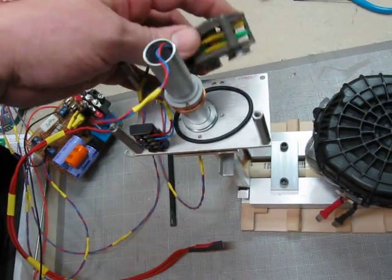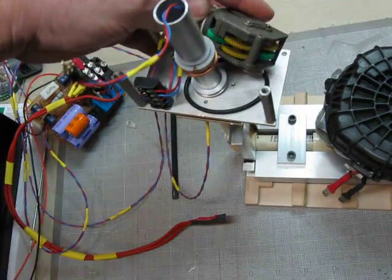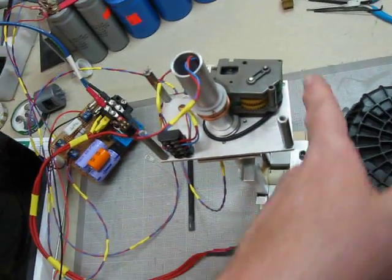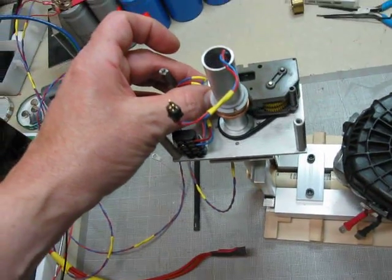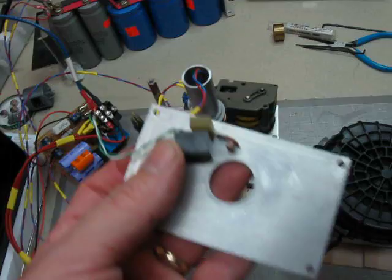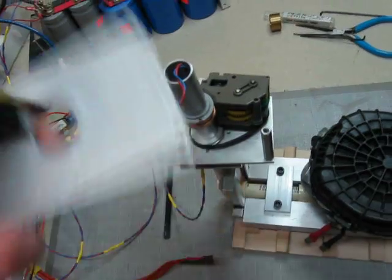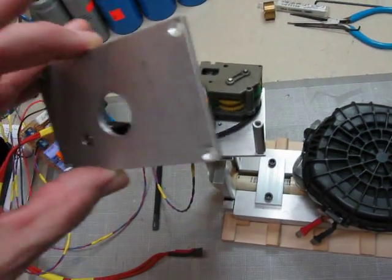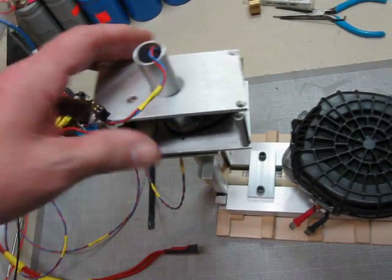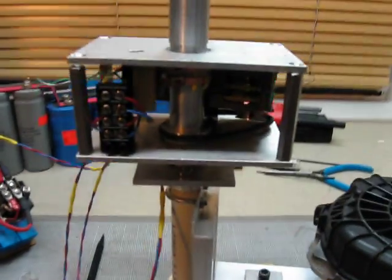It's got a pulley on the bottom there. It attaches here kind of like this and sits in there like that. It's only got four standoffs on three corners because there wasn't enough room to put one there — the rotator motor sits there. Then the top of the rotator here has the chopper brushes on it, which are right there. The brushes are actually just taken out of the same motor I used for the chopper motor. This goes on top like this, and the brush sits right against the collector rings — you can't really see it in the dark.